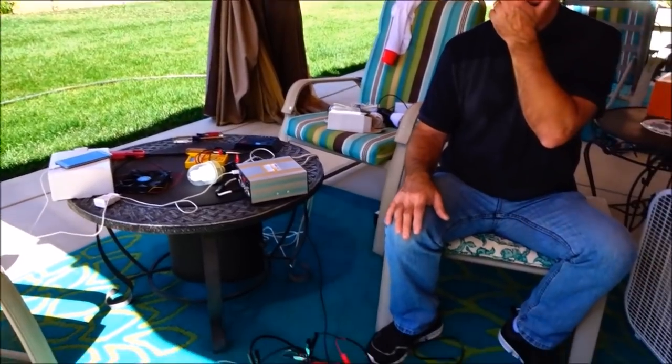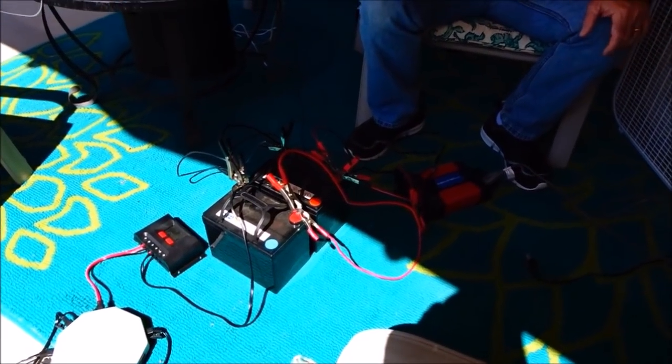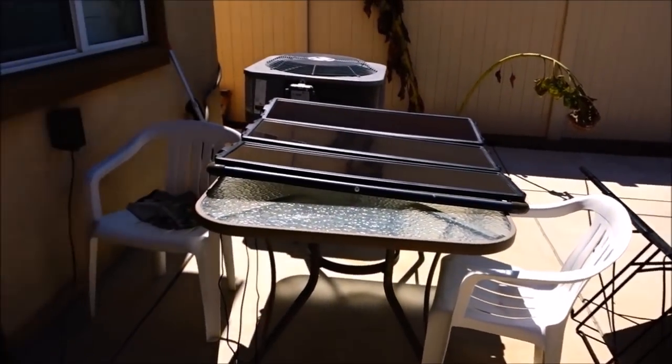We run about 60 to 70 watts in our van, so for 6 to 7 hours after the sun goes down, we don't have to think about it. If we did deplete the batteries of the 420 watts, we have 190 watts of solar — and at any given time, say you have 100 watts, it only takes about 4 hours of sunlight to recharge your batteries during the day as you're using power for the next day. That's what you have to configure based on what your devices use.